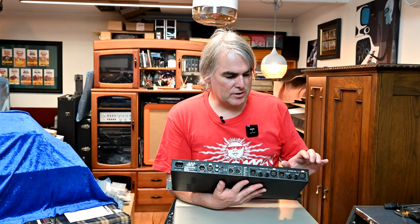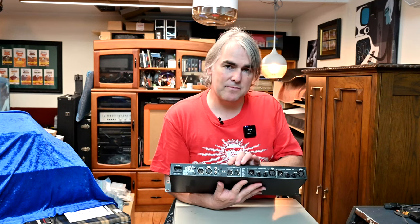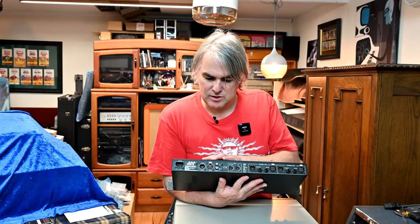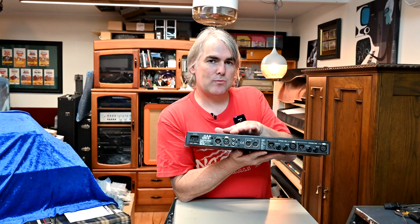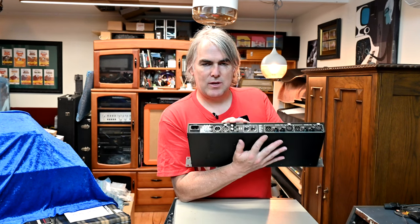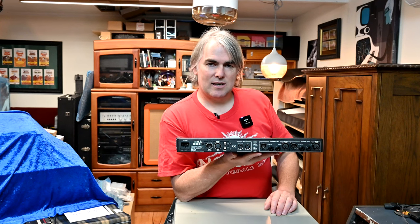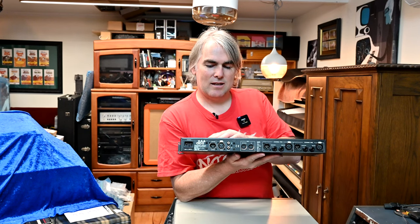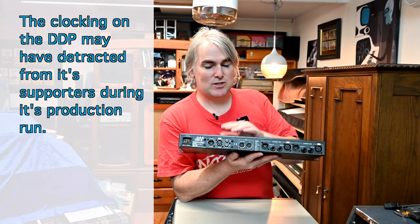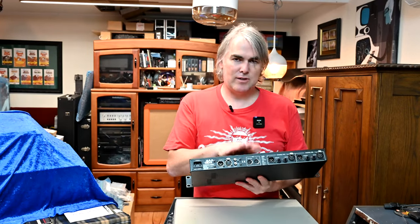On the back, as you can see, we've got balanced inputs and outputs in both the XLR and TRS variety. We've got MIDI, so it's recallable in that regard. And then we've also got some digital inputs and outputs. It has SPDIF on RCA, and of course SPDIF will carry clock with it. The AES-EBU would normally be accompanied by a word clock or BNC connector, and as you can see, that is missing here. So if you are reliant on word clock, that may be a limitation. Maybe they should have put a BNC connector on it. The fact that it's got MIDI makes it recallable.